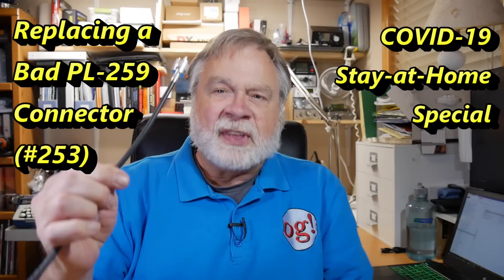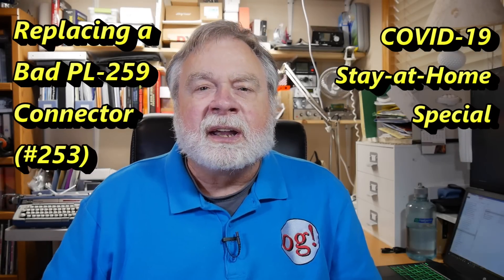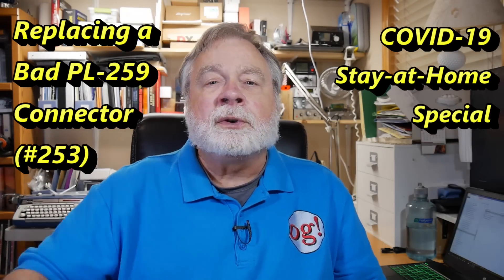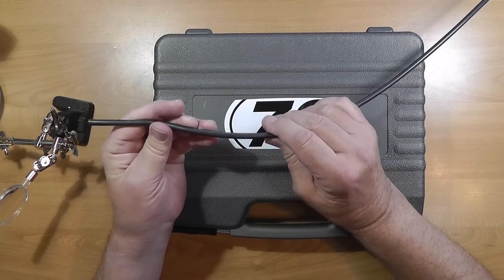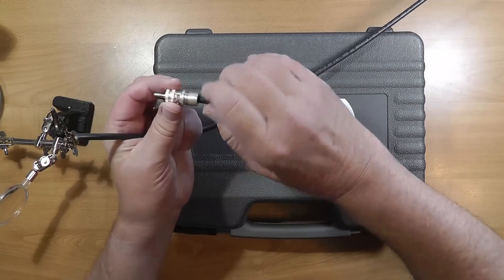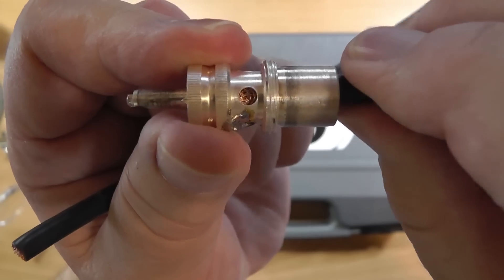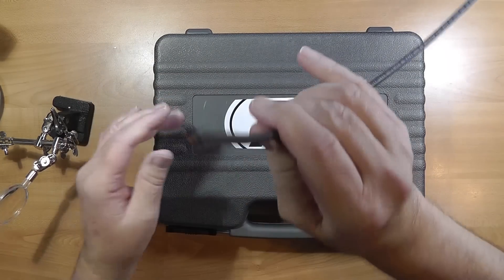But I had a problem. I have a VHF UHF antenna outside, but the cable on the inside of the shack was bad. The PL259 was bad, so I cut it off — I'll show you in the video why — and put a new one on. That's our job for the next several minutes: put on the new connector. It's RG8X, and the old one ran into trouble with the connector rotating and disconnecting all the wiring. So we're going to do away with the soldered connector and put a crimp connector on here.